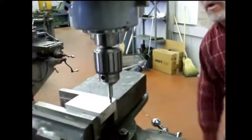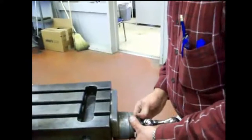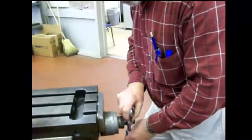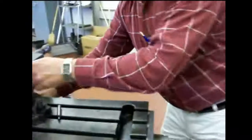The diameter of the pin is 200 thousandths. So if I lock this axis and set this at 100 thousandths, and unlock it — now whenever I take it to zero, I'm right on the edge of this surface.